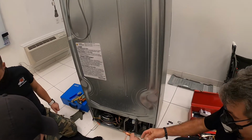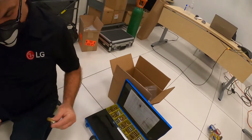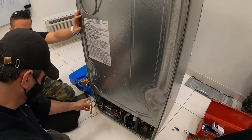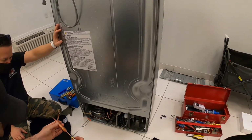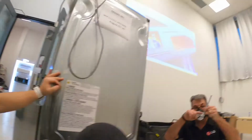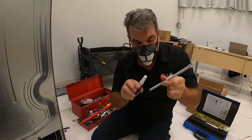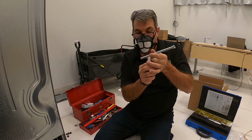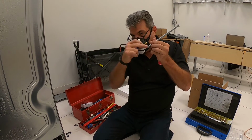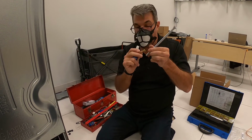This is the dryer. And the connector for the dryer is a 4 to 2 millimeter on this side, and 4 to 4 on this side. Exactly. What you're going to do when you have a vertical connection is put a drop very high, and then use the tip and spread it out and enter right away. Don't let the drip go down and block the hole. That's how you block a hole.